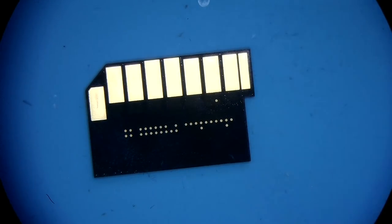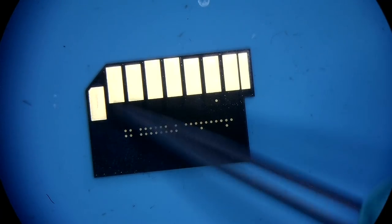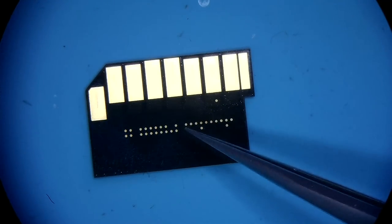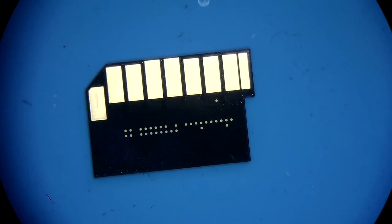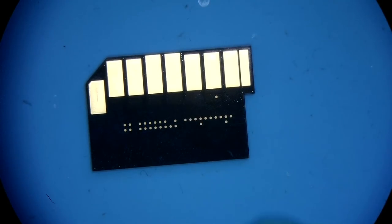Right now, all of these three tools that we went over communicate with the device using this interface, different protocols, but this interface, and that interface talks to the controller. So the controller has to communicate later on with the NAND and get some information from it and update the tool. But if that information isn't coming out completely and intact how it's supposed to be, we get either no access or partial access. So our job here is to access the device's NAND, and the NAND can be accessed through the NAND protocol.